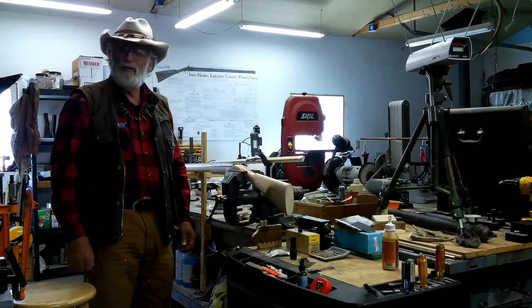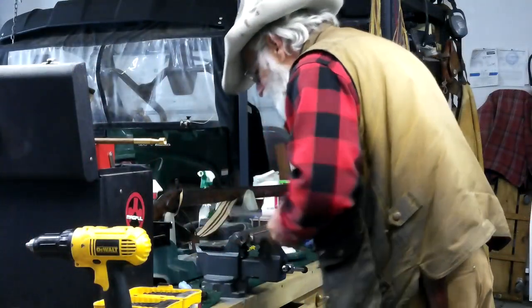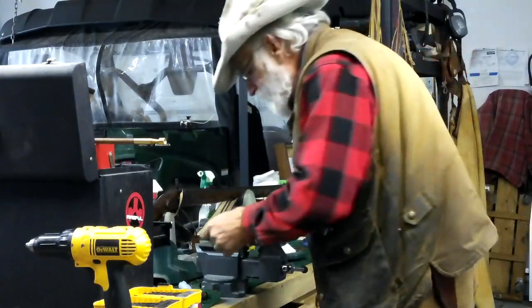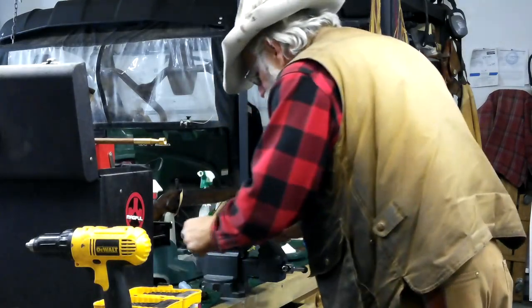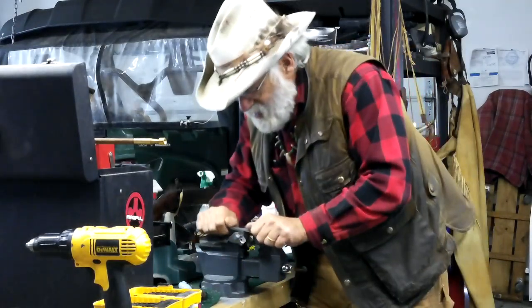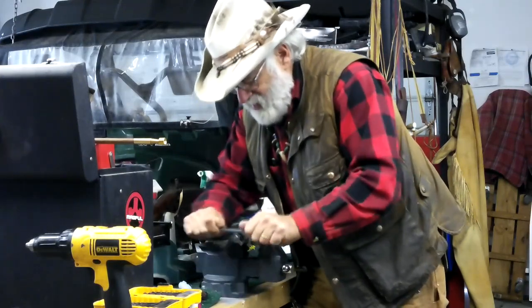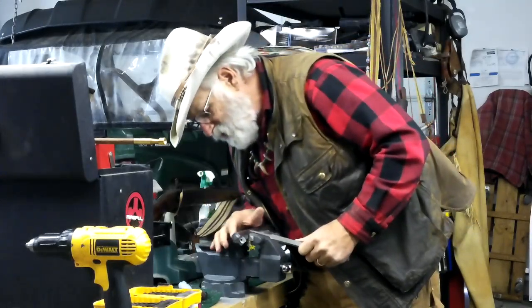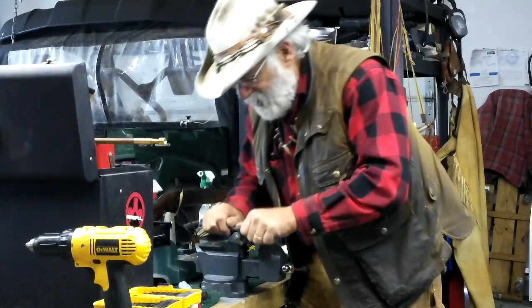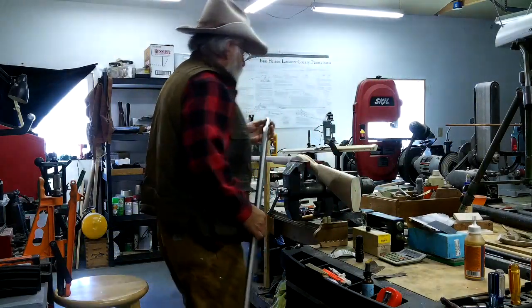You guys are welcome to join in while we're doing it. I'm going to get these polished off and get started. First I'll file it down — it's about 30 thousandths too big. I'll draw-file it so it all comes out even and straight. This is the first flat past the top, so I want it to be perfect. The next one and the bottom flats need a little work too. I like to get them all looking nice.